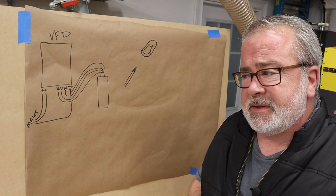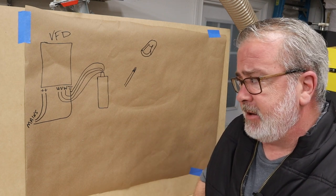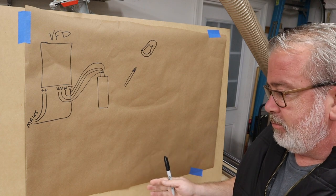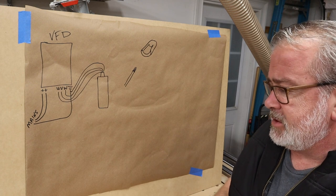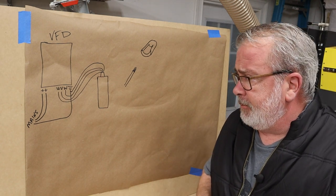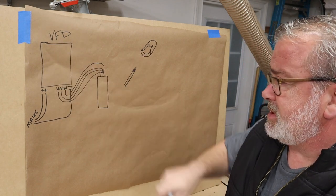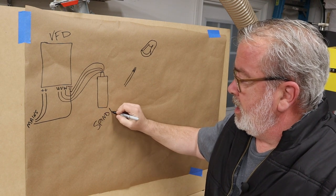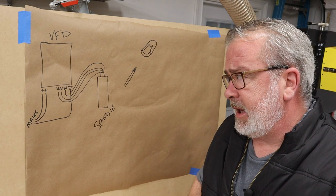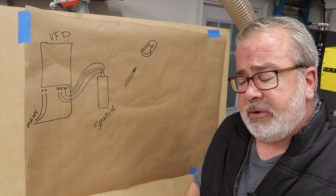This is the other end of the spindle wire, and this is going to go to my VFD eventually. As a last check, we should have some resistance between the poles of our three hot leads, but we should not have any continuity to ground — just making sure we don't have a short. So we're dealing with electricity — you want to make sure everything is as you expect. None of these leads are shorted to ground. We have a very good connection to the spindle body. With 240 volts, you don't want to play games. Everything's good, so now we'd be ready to fish this through the rest of the way and terminate it at the VFD.